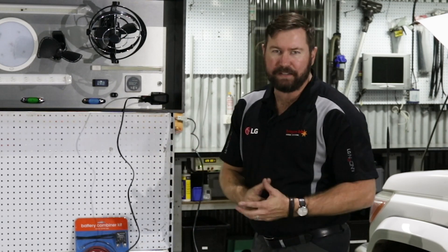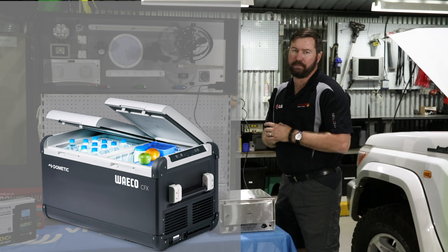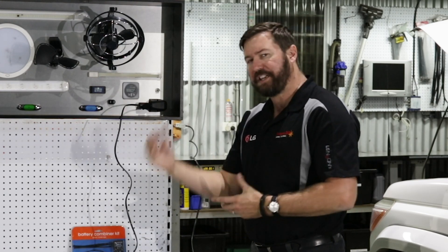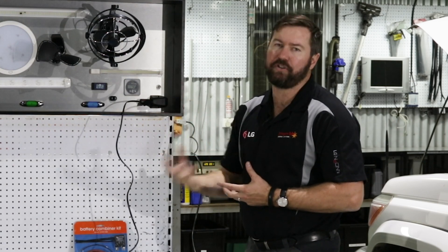If you're running that fridge in Tasmania you'll get it below 20 amp hours a day — less than an amp an hour. As we go up in refrigeration size we start drawing more energy. Going to your 50, 60, 80, or 110 litre fridge, you start drawing more and more energy out of your battery system. We need to size our batteries accordingly and ensure we're charging them enough. A 60–80 litre fridge will draw 50–60 amp hours a day; a 110 litre fridge draws between 50 and 70 amp hours a day — all depending on how cold you run it and whether you're loading it with warm food or drinks each day.